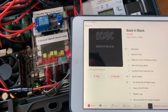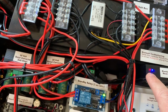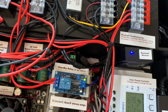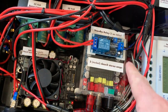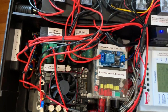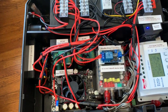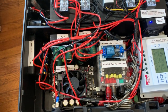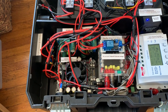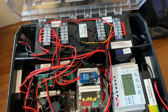I'm playing music here — let me put it on pause. I put it on pause and you should see this light on the left go off. The relay has tripped off and now the amps have turned off. In this standby state it only draws about 0.1 amps — about an eighth of the power — so the battery lasts a long time. And even during standby, Bluetooth is still working, still looking for someone to come play music.